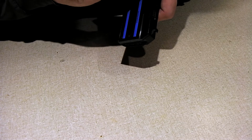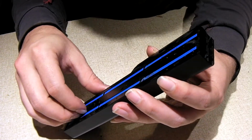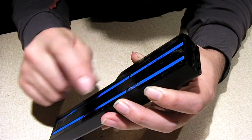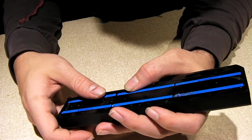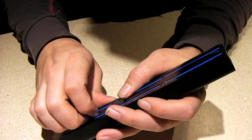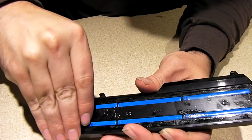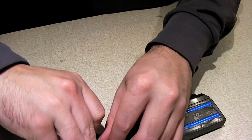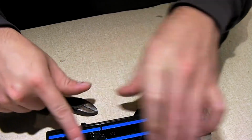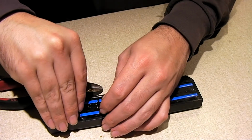The thing is, you've got to be careful when you go to tearing these things apart, especially in the cases where they're difficult to get into, because these cells typically have charge on them. Well, you want them to have some charge on them if you want to actually get good cells. But you've got to be careful that you don't short anything out, because you also tend to have wires in here that run between the parts of the pack. So you've got to use caution with these things. When you're using a screwdriver here, or any tools for that matter, you don't want to put down a lot of pressure on the cells. And also when you're in this area, or anywhere in between the cells, be careful, because there are contacts in there that you could short out if you're not careful.